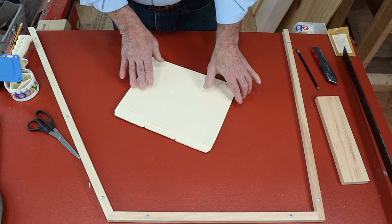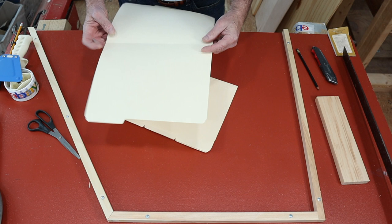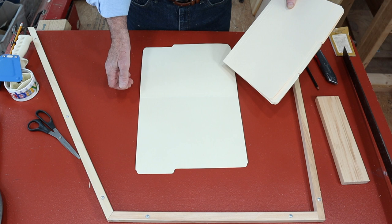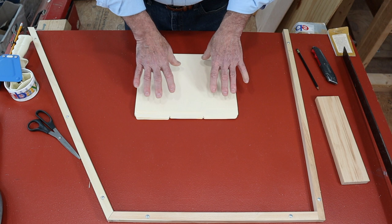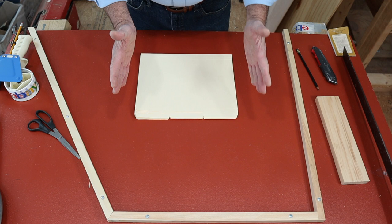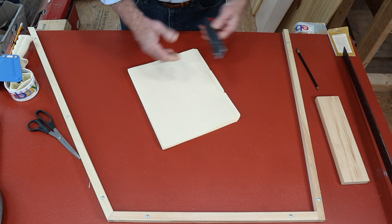To make a transferable file folder pattern, you're going to need file folders — just common file folders, heavy stock paper. When you unfold them, they lay flat, and that's the nice thing about these. You can keep a box of these behind the seat of your pickup truck. I always had file folders because the applications for this idea aren't just for sheet goods — you can use it for laminate flooring and tile and things like that where you have to make a fit against a complicated shape.